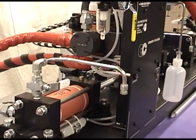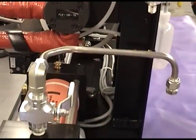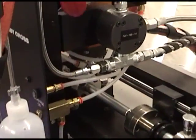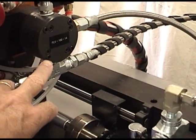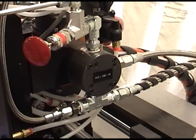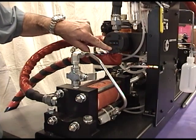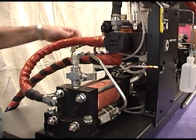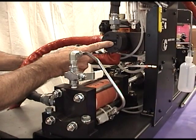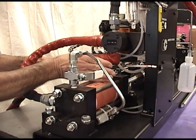How does this system fill and dispense? There are two rotary valves — one for the resin side that fills and empties the resin cylinder, and one for the catalyst side that fills the catalyst cylinder. Both are operated by a single actuator. Material flows in from the tank through the hose into the rotary valve and then into the metering cylinder, slowly filling it.